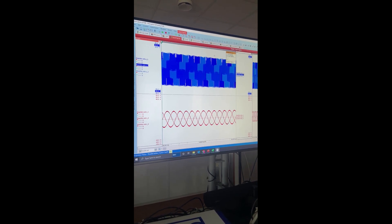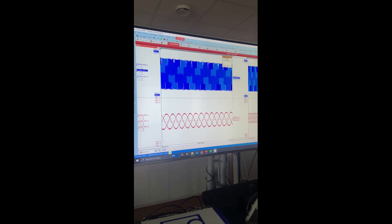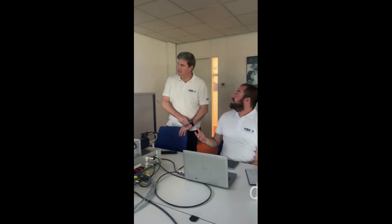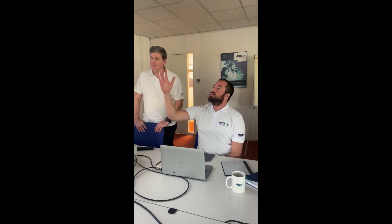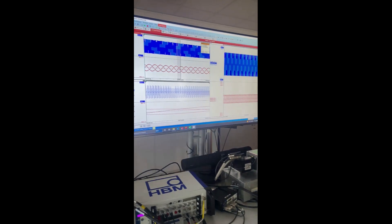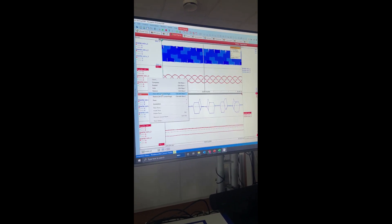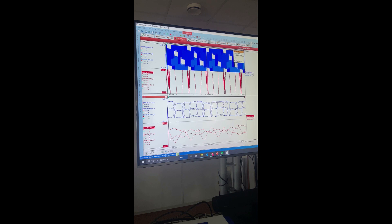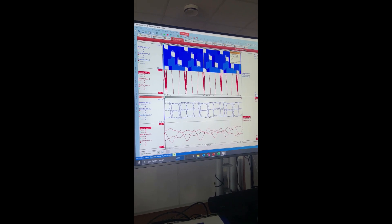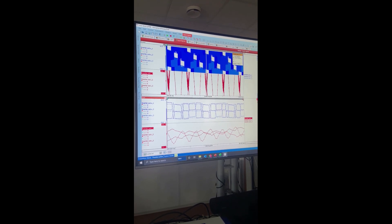So why is that good for a customer — to look at the current ripple? Looking at the current ripple is the relation between the voltages and the currents. Which sounds trivial, but you've got these really sharp rise times on your voltages, as can be seen on screen here. And you can actually see that current following the switches. That current ripple gets translated to torque.